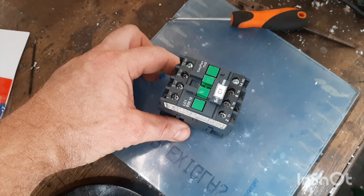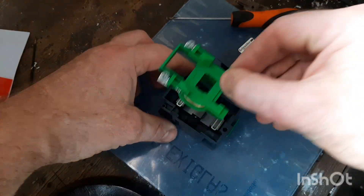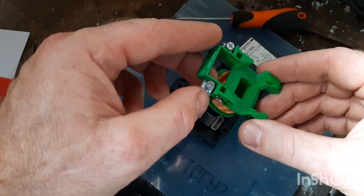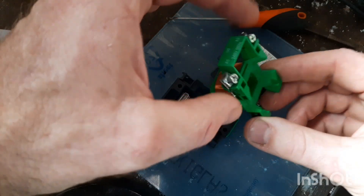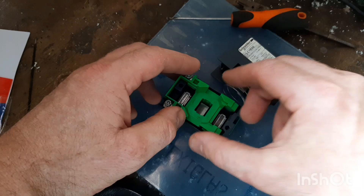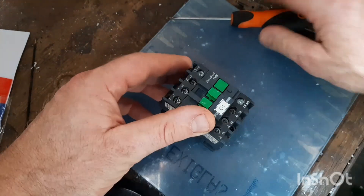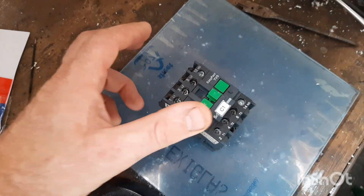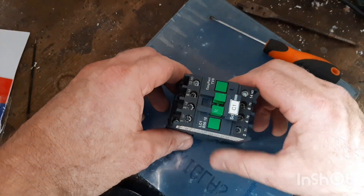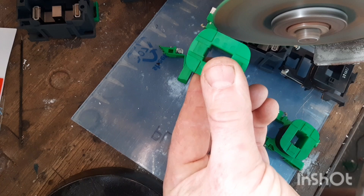For the winding of this generator, I'll be using coils from a contactor — quite a few of them. How this works is that live and neutral come onto two points, causing an electromagnetic field which pulls a steel armature in, closing the contacts and allowing a large electric current to flow through them. That's how a contactor works.